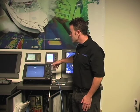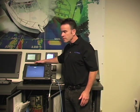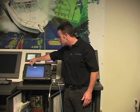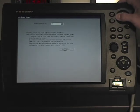It's important to note that in this video we have a single X7 series radar and a single multifunction display. Because of this, we're going to want to make sure that this single MFD is set up as a master — meaning the master DHCP server setting is going to be set to on. Once that's done, we're going to go ahead and hit the next tab.